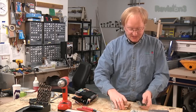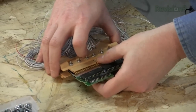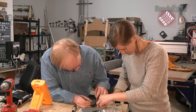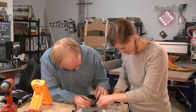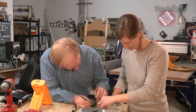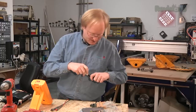I've sanded the solder mask off of this old game so I can actually test the connection. We're going to compress this lightly and make sure everything is connected on both sides. Going one at a time — so if there's a short, you know it. The short between those two — that's why you kind of stair step. Okay, so those two are a little weak so we will take a look.